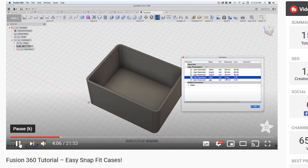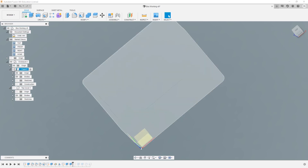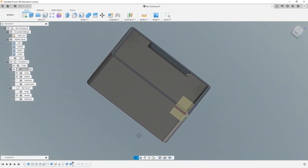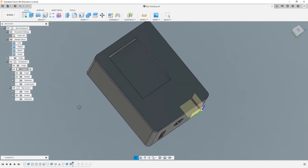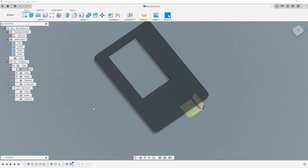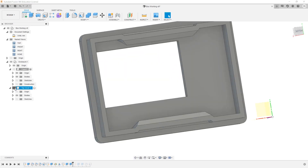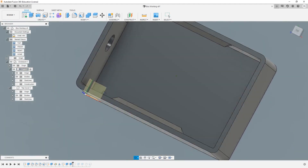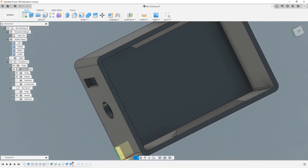Over on the Adafruit YouTube channel, Noe and Adafruit had the answer — a full tutorial on how to do a snap-fit enclosure in Fusion 360, and it's parametric so we can resize it even for our ground station when we go to build that. A few hours in Fusion 360, I was able to follow the tutorial to the letter and here's my design. You can follow the process or just use my files down below if you're building a similar thing. The box is parametric so you can just change the sizes and the user parameters to suit your application — it's absolutely wonderful.